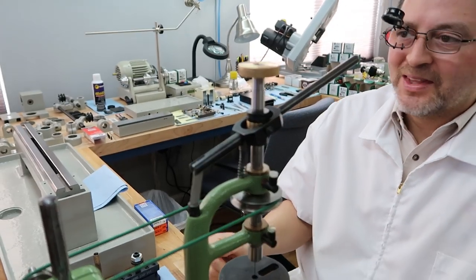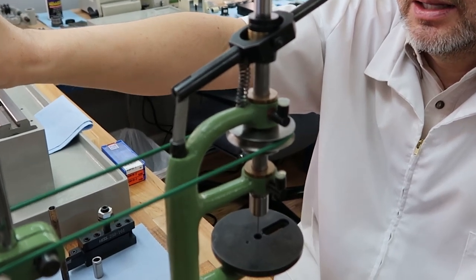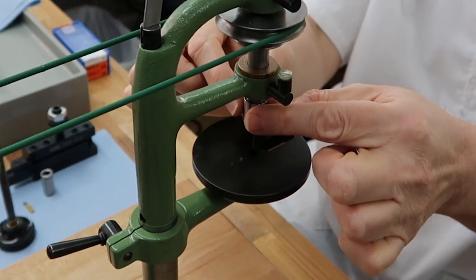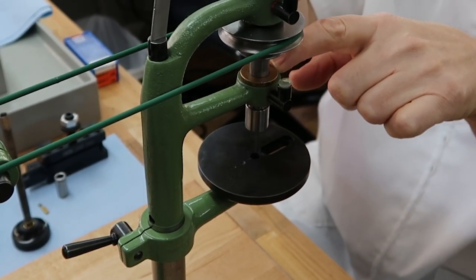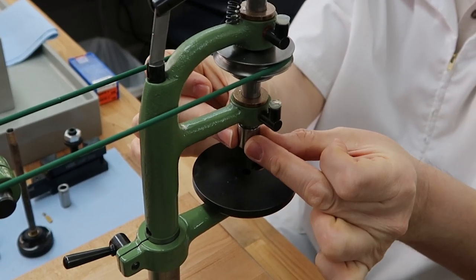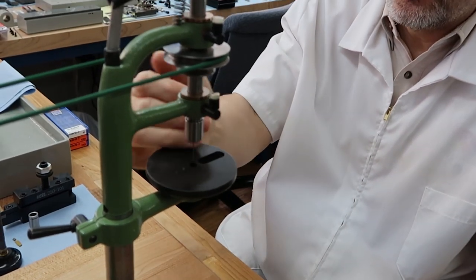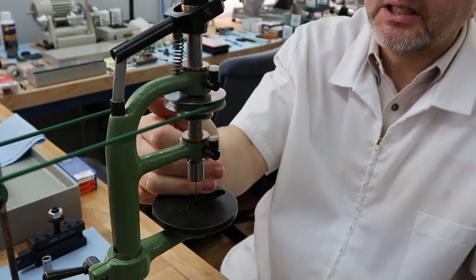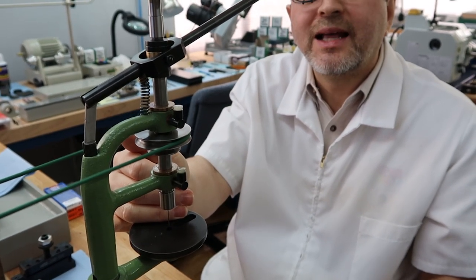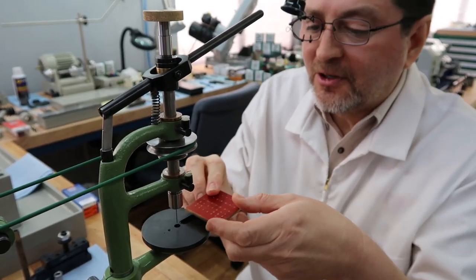Let me turn it on really quick without anything. What's nice is because we remachined these bronze bearings, the spindle is tight. There's absolutely zero, no detectable play, I should say. And you can see the drill bit, there's no wobble. The spindle is very true. So very lucky. You got that, Lance? I got it. Perfect. Okay, let's go ahead and drill our first hole.